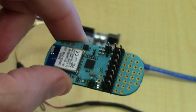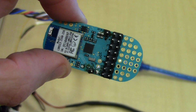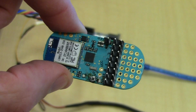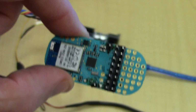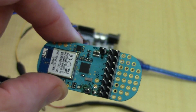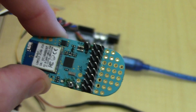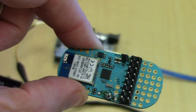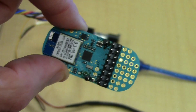We got it working with the LightBlue Bean, except that frequently and somewhat randomly it would drop a lot of characters on the typewriter, and this was definitely painful because we had no idea if it was the Arduino, the LightBlue Bean, or something wrong with my soldering. And of course, because this is my first time doing surface mount soldering, I thought it was my soldering, so I probably resoldered those shift registers 20 or 30 times, thinking that was the issue.